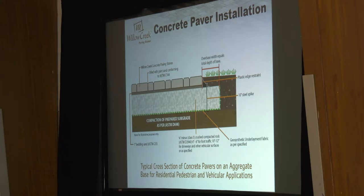Looking at the cross-section again, the pavers are up on top. We go ahead and lay those pavers in and then run a plate compactor over the top of them. It seems a little counterintuitive, but when you run that plate compactor over the top of your pavers after you've laid them, you do a couple of things: you seat them into your bedding sand, and you achieve a level of uniformity you wouldn't be able to otherwise. The plate packer takes the surface from minor inconsistencies to like glass — that's what we want to see, a nice flat, perfect top surface.